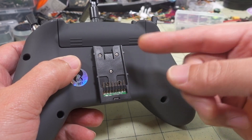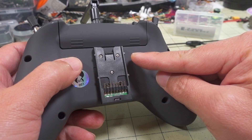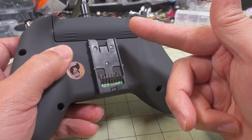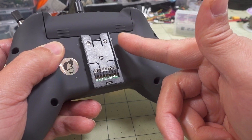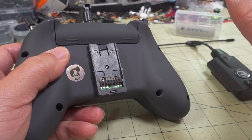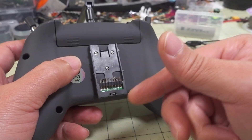What happens is basically you have a failure and the radio starts acting very strange because that large power draw taxes the components on the main PCB board. In my case, I actually burned one of the transistors that controls the power on/off function of the module bay. So when you normally change your model from an internal module model to an external module model, it'll switch power off to the internal module and power on to the external module — and that mechanism is broken on my radio. So I can't show you the other two mods I'll talk about later in the video.